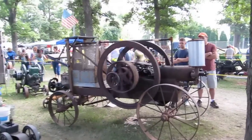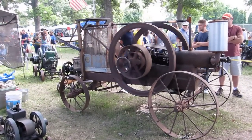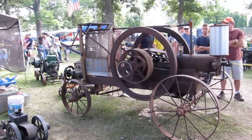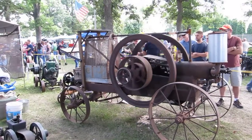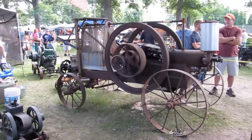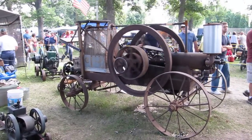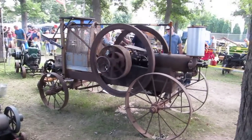That is a screen-cooled, 10-horsepower International gas engine. It pumps the water up, it goes over the screen, the water going down the screen, the air evaporates it, it cools the water, it goes back in. 10 horsepower. Made in Rochelle Park, Illinois, in a factory by actual Americans — casting metal and machining and things like that that we don't do anymore.